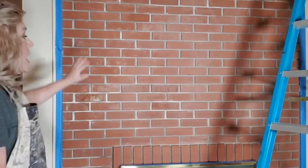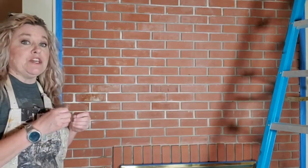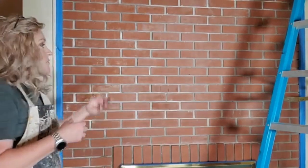I know a lot of people have questions about working with bricks. These are red bricks, and sometimes you have a little bit of a hiccup when working with red bricks because of the deep red undertone. What we're going to talk about tonight is color washing bricks — you don't want them to look painted, you want them to look color washed. When color washing red bricks, you need to use a gray undertone just to neutralize it. That's not to say your finished product has to be gray, but you do want something with a gray undertone.